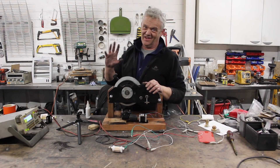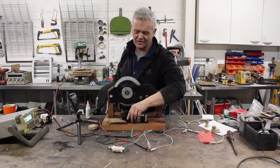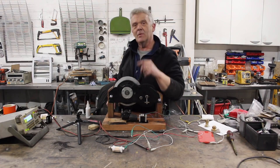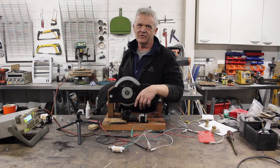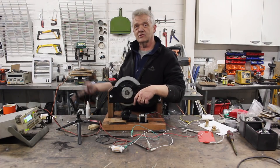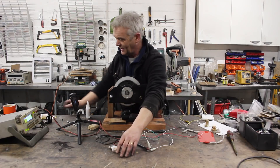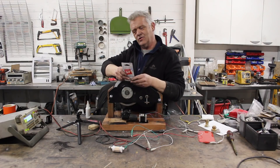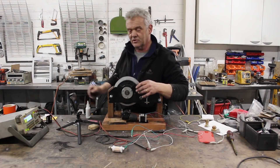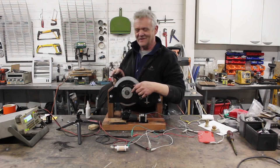To be honest, it is knock-your-socks-off stuff. There's the stepper motor — just an ordinary small stepper motor attached to that drill — all set up with a pulley on it. I just spin this handle and it will generate. Stepper motors generate AC, so you have to rectify if you want DC. Inside there are two coils, so I've wired those coils in series so the voltages add up. I've got a household UK fitting — meant to work at 230 volts — and we're going to see if we can light it by spinning our electric generator.